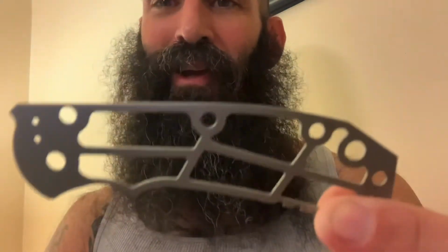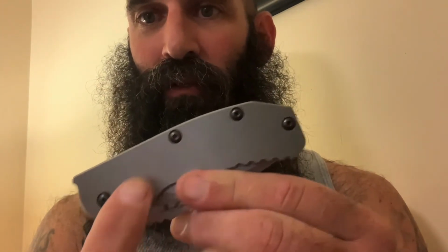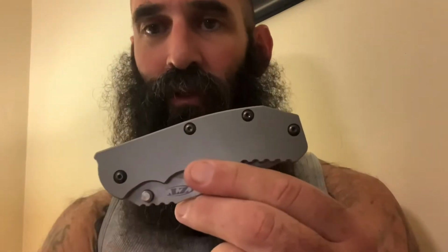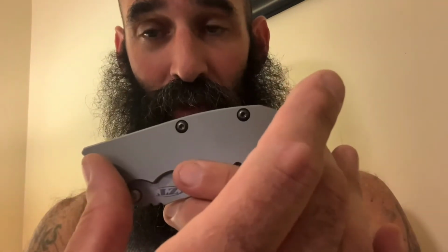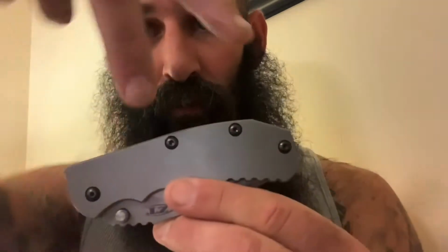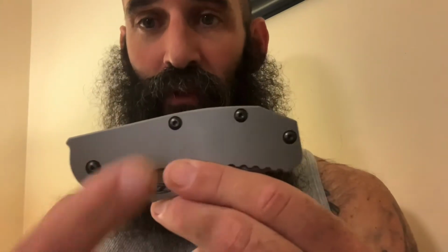Let me back up a step. I missed a step, sorry. On this other side, they had to be counterbored for all the screw heads, the button heads, to fit in there. So it's a 50 thou counterbore. I measured those sizes and did that first. After I located the part with the pins, I clamped the material with just 1/4 inch clamps. After that, this is when this step starts.